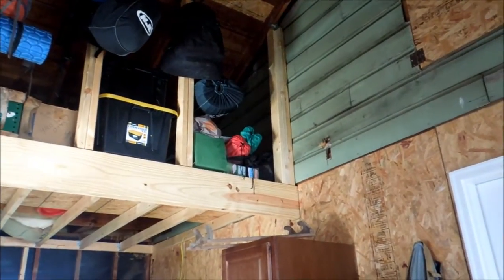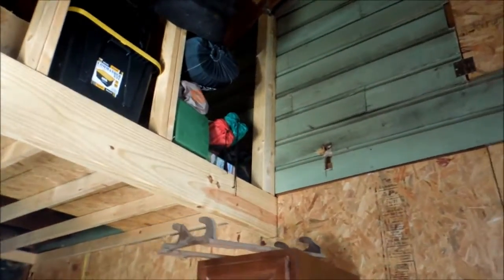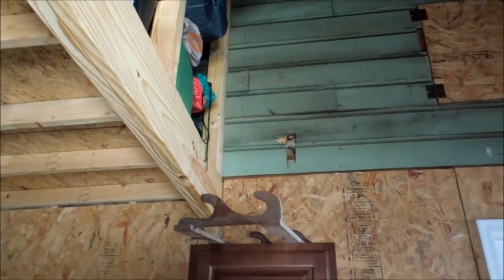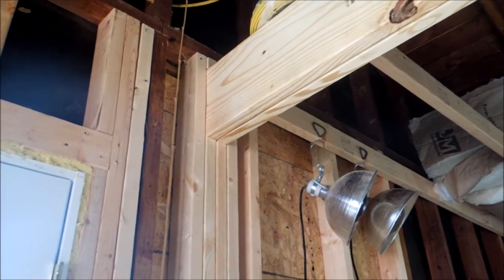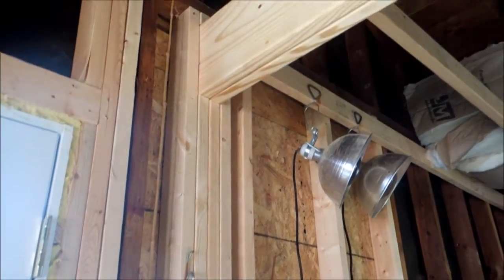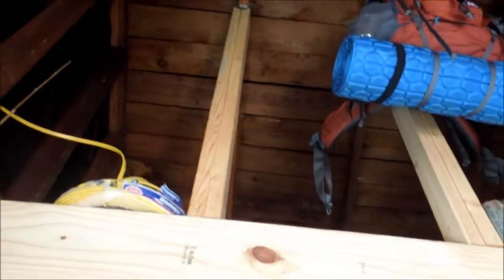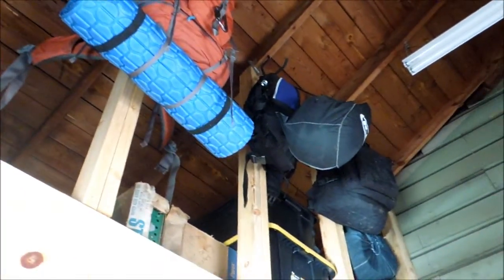And so when we bought the house, what we did was, when the framing was exposed, I put these header beams in, and they just run from one side of the frame of the actual house to the frame of the garage wall here. And I just put in some cribbing there, some posts to hold those up, and then we went back and put in some purlins here to hold up the roof structure.